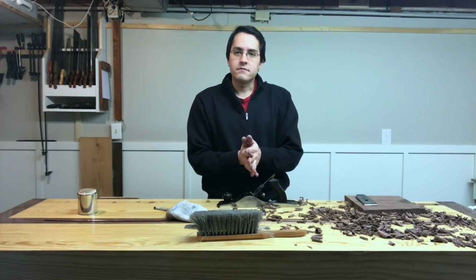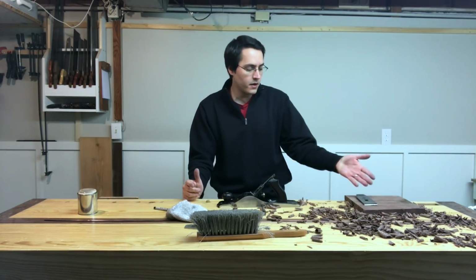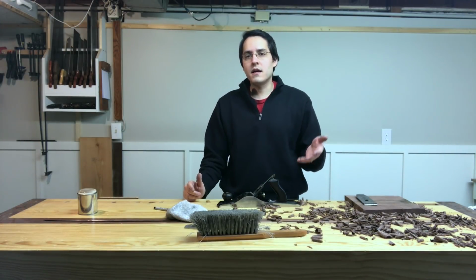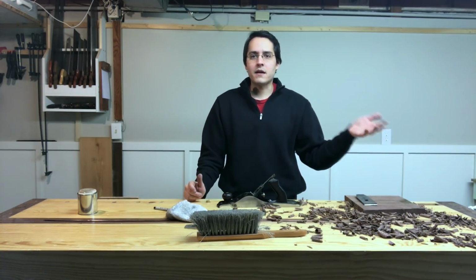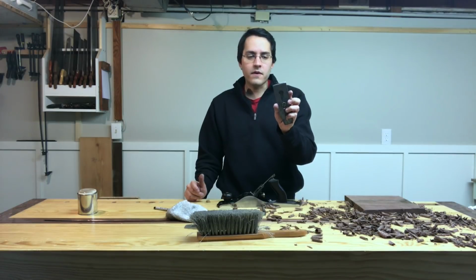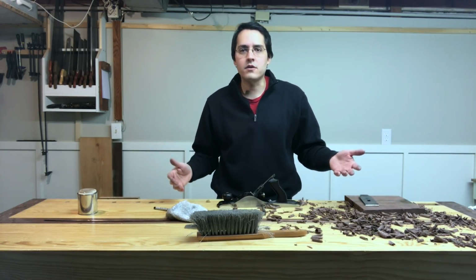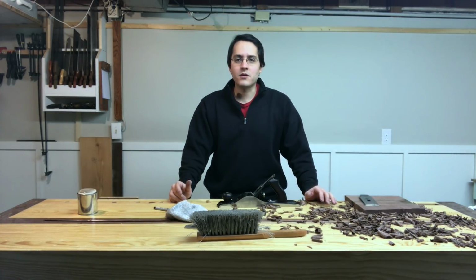So thanks for watching. I hope it's been enjoyable and useful, and maybe you can set up an extra plane blade that you get or have and convert one of your old irons into a scrub plane iron. Put it back in commission. This one here, like I said, was running out of life. It had a lot of pitting on the back, and I bought a new iron to replace it, and so now it's back in action, and I couldn't be happier.